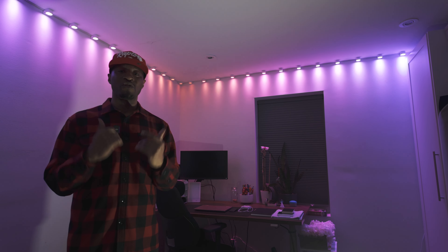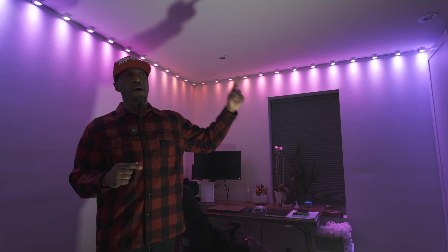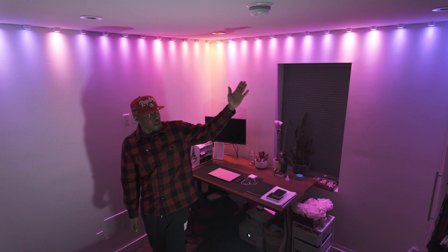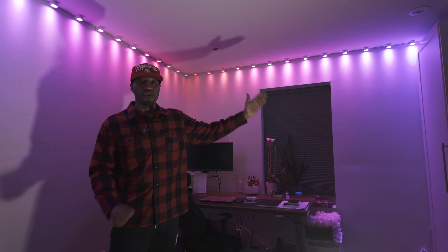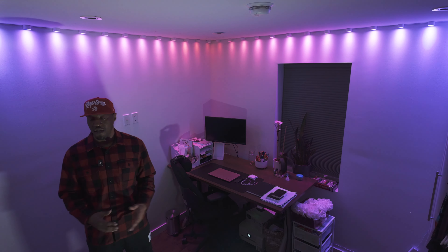One of the main factors when purchasing these lights is how you're going to install them. These particular lights can only be installed in one direction — because of the way the adhesive is set on the individual lights and the way they stick against the wall and not the ceiling, you have to run the lights from left going to right. In this far corner, light number one of the 25 starts here, and I'm able to hide the cable down to where the controller is, then running to the power supply.